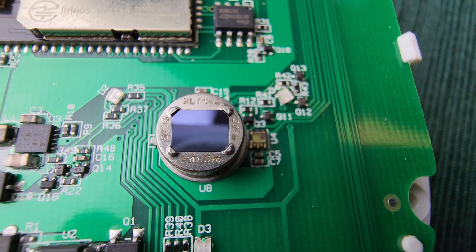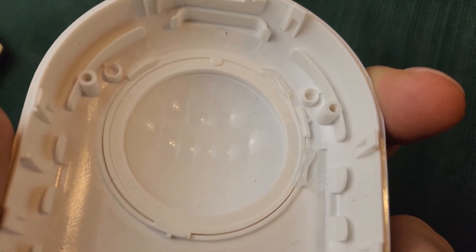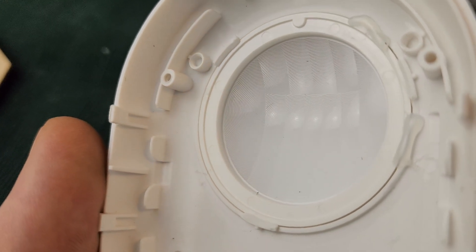Elephant number one: this other really cool looking thing here is the PIR, or passive infrared sensor. This thing is even more astounding than you know. The way this one works is by having a bunch of little pairs of pyroelectric sensors in it — a pair per detection area. A pyroelectric sensor is a heat-sensitive film suspended in nitrogen that picks up minute infrared waves. If something emits heat, the pyroelectric sensor can sense it. The reason they are used in pairs is that you don't just want to detect heat — you need to see localized changes in heat. So if one of the tiny sensors picks up more heat than the other, the detector sees that as the movement of a mammal. The reason the lens is divided up into sections is so you can sense a lot of smaller areas all at once and compare the results to gauge whether said mammal is a human or a cat. If you are worried about lizard people, you'll need to purchase a dual sensor that also incorporates a microwave proximity sensor as a redundant means of motion detection — and you can, those are pretty common.